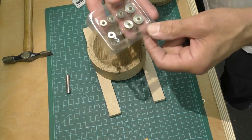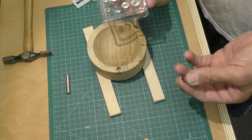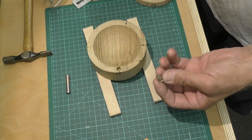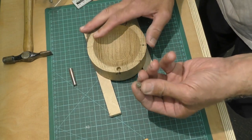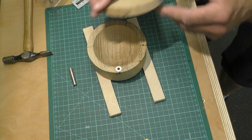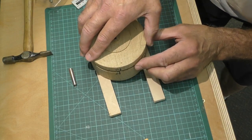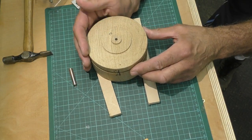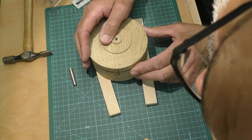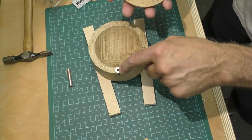The reason we drilled a hole first was for this method to work. I'll be using dowel pin centre finders — used when doing dowelling work to find where to drill on both surfaces that need to be joined. They're very inexpensive; you can find them on eBay. This is 8 mil because the rod is 8 mil, so you find your 8 mil one and slot it into the pre-drilled hole. Then line up the lid, get everything as close as you can, press, and there is the corresponding hole.